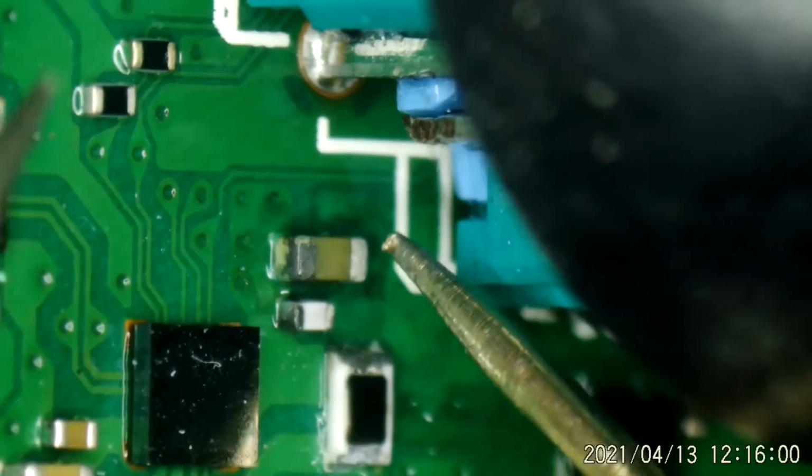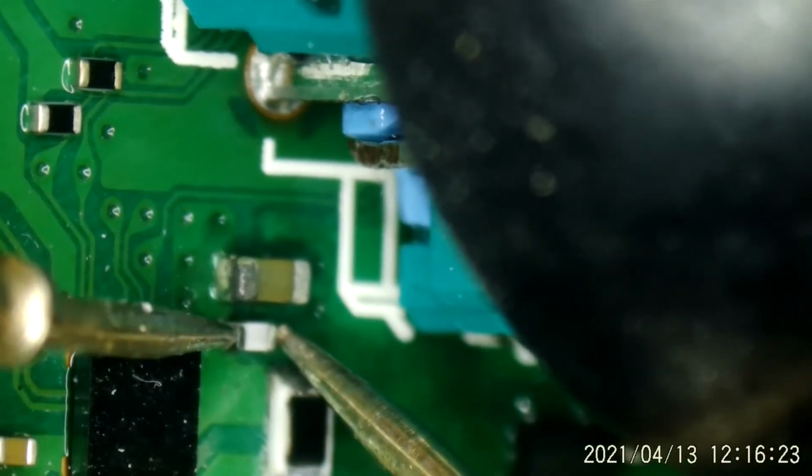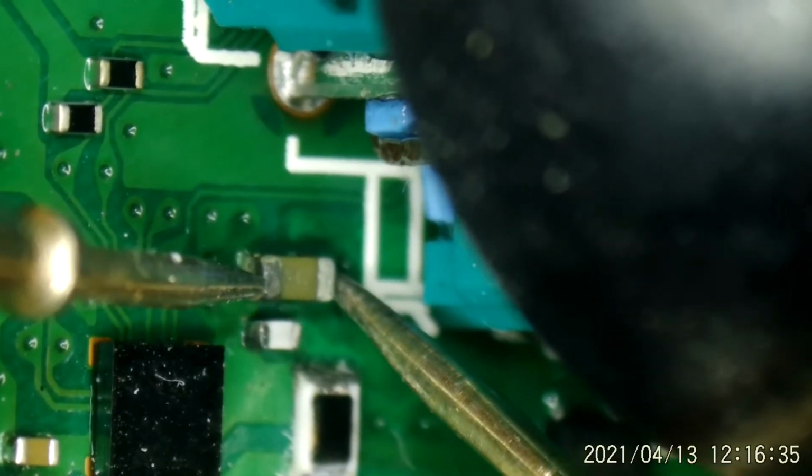Maybe I'll just measure right across the capacitor there. Nope, she's not gone. There's actually two capacitors there in parallel, aren't there? Well, what happened? Okay, now the end cap's just in bad shape. Alright, what about this one? That looks to be in parallel with it, unless my eyes are playing tricks on me, but it doesn't really read shorted there. But it does there.